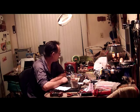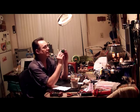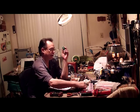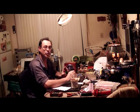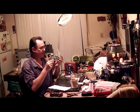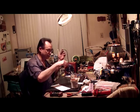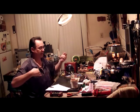Getting back to business — tools. This is a handy little contraption. It's a pill bottle that I cut down and put a quarter-inch female guitar jack in it, and on the other side there are color-coded wires. This is stranded wire, and usually I'll solder on little pieces of solid core wire so you can stick them right into a breadboard. What you'd use this for is — this plugs in here, then into your amp, and you connect these two leads to the output. I have another one of these for the input to plug into the guitar. That's how I get the signal in and out of my breadboards.